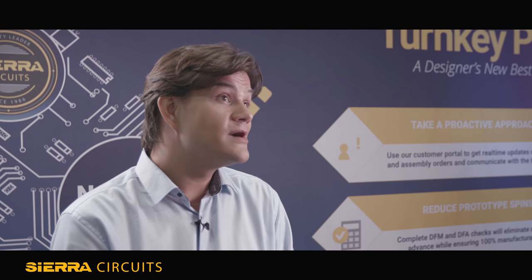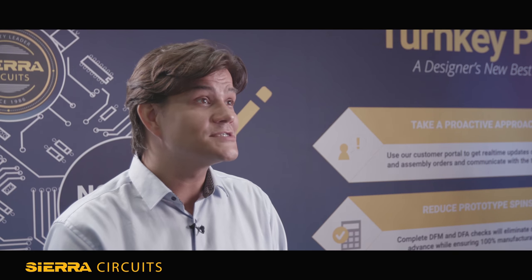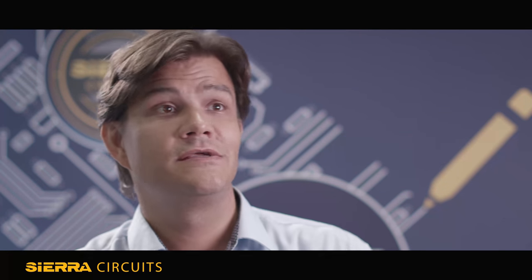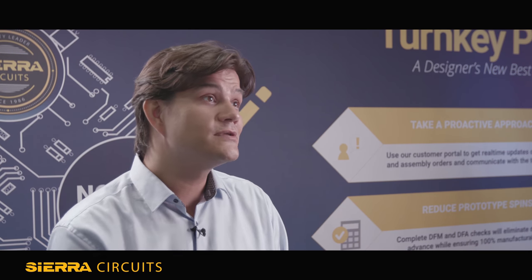When designing for printing on the Dragonfly, our goal was to put none of the effort on the designer whatsoever. If we interrupt their normal workflow, nobody's going to want to use the system. So the printer and software are designed to be completely backwards compatible with traditional Gerber and Excellon files. If you can export in Gerber format and export your Excellon, our software will essentially port that over. You check the stack-up — the one piece of missing information in those Gerber files is the Z-height of any given layer — and once you've input that, you hit print.